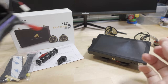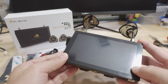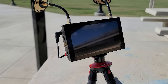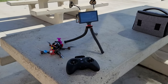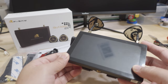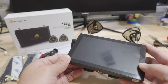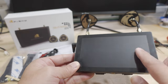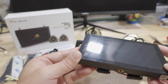That old monitor happens to have HDMI in. This new screen is a little bigger — 5.5-inch versus 5-inch — and it's 720p, so the resolution is higher and it just looks a lot better. However, the screen isn't as bright as I'd like. It's only 340 nits, which isn't super bright for outdoor use, so I had to sit under some shade. It was flyable, but I did wish it were brighter. There are also no controls in the current firmware to adjust brightness, contrast, or saturation. The screen is also very glossy — there's even a screen protector still on it because the screen underneath is even glossier — which doesn't help for outdoor conditions.